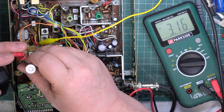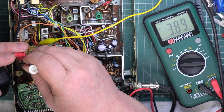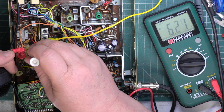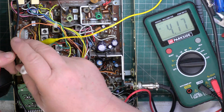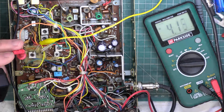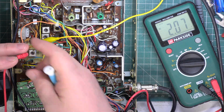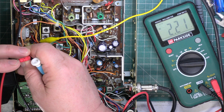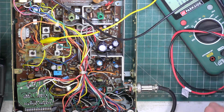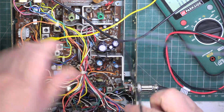I think you've taped business radios. So receive 4 volts, transmit should be 4 volts, receive 4 volts, transmit 4 volts. Go to channel 40, go to channel 1. Should now have around 1.8, 2.3, which we have, and we should have the same on transmit, which we have. So as far as I can see, the phase lock loop is locked. So let's now do some proving.